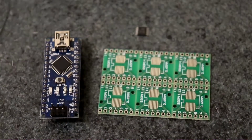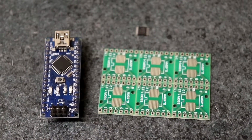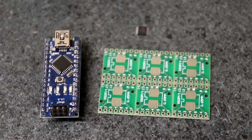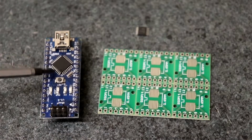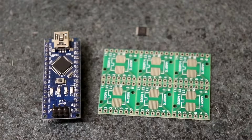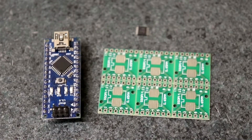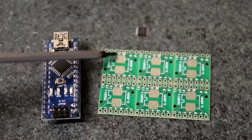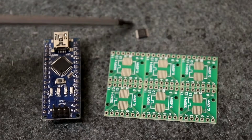Okay, so we're going to have to use our PS2 controller analog stick, obviously, for our analog input for the PSP, because it has a joystick. Now, as you can see here, we've got a few little things going on here. This is our Arduino Nano, and this will be what attenuates most of our inputs and pushes it back to the PSP from the controller and makes sense of it all. And this here is our little breakout board for this, which is a dual channel digital potentiometer.